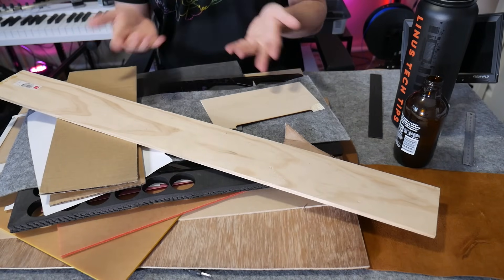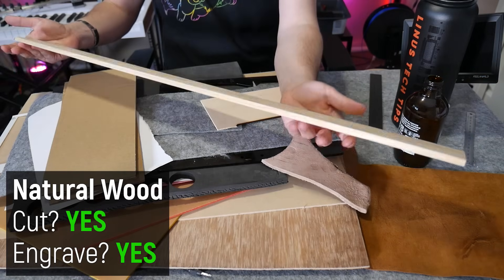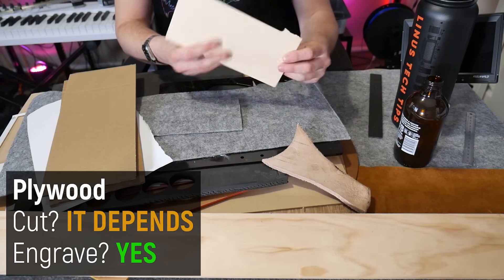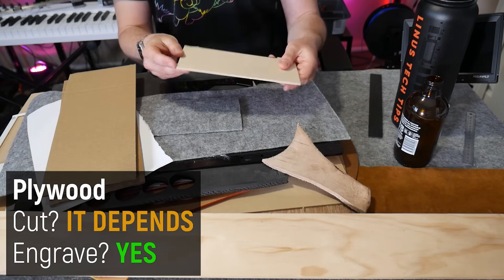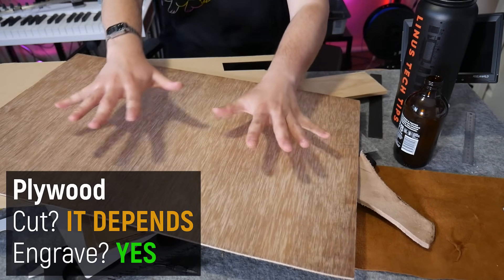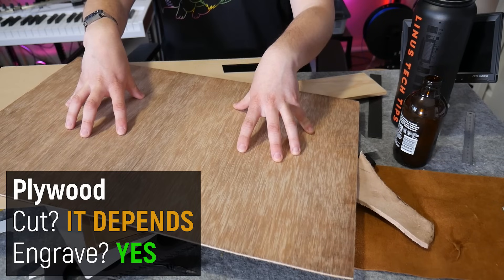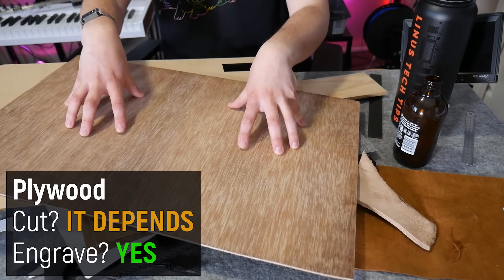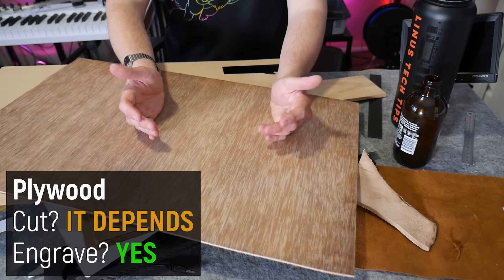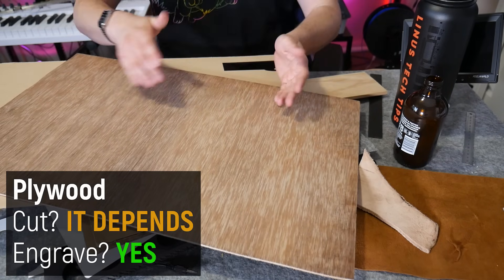What about wood? If you're cutting pure wood like this piece of pine that's not treated in any way, it's literally just like burning it and the byproducts will just be wood smoke. But then you come to materials like plywoods. This is laser plywood designed specifically for laser cutters, laminated with a glue that is supposedly safe to laser cut. But structural plywood uses a formaldehyde-based glue, and you don't want to be burning anything formaldehyde-based — it also laser cuts really badly. MDF can have formaldehyde in it as well, depending where you're from and what grade it is. In Australia most of it has formaldehyde, but overseas there are low or no-formaldehyde grades that are probably much safer to cut.